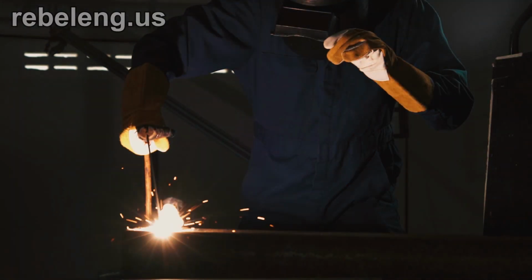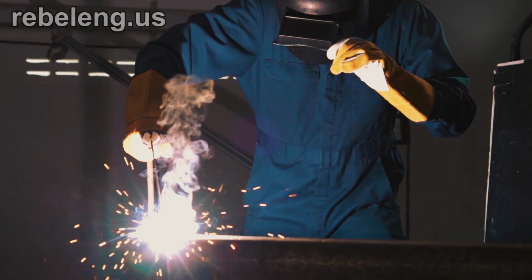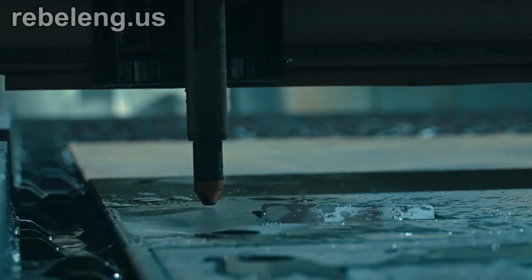Inside the cutter, a gas is passed through a narrow nozzle at a high speed. Without the ignition process, we just have several hundred volts of DC power on the end of a torch doing nothing. Think of this like an arc welder that has power but has not contacted the workpiece yet. When we touch the welding rod to the grounded part, it makes an arc and we can get to work. This arc is maintained so long as we keep a correct distance between the welding rod and the part being welded. This is what we need to accomplish with the plasma cutter, but ideally without having to touch the workpiece.